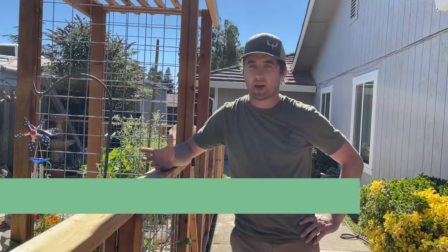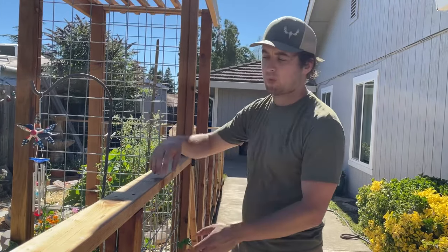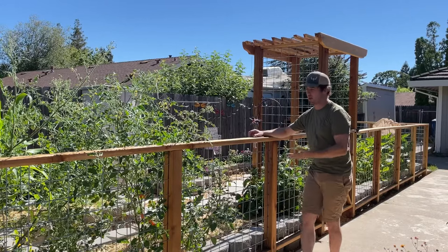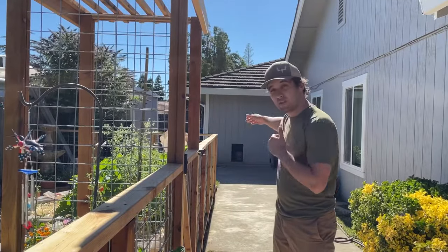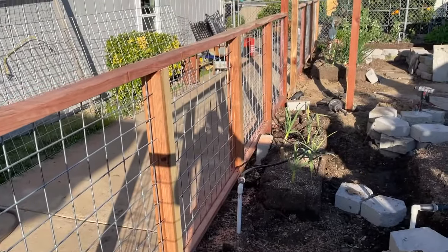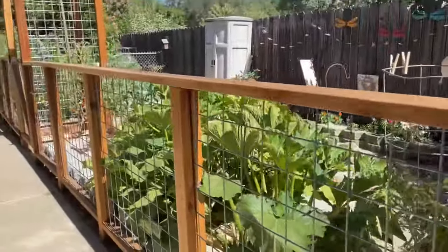The last step is setting your top bar — lay as long a piece as you can across the top and screw it in. Use a string level to make sure everything is level before setting the posts. For long runs — this one was about 14 feet — be really picky at the lumber yard and pick a nice straight board. It'll make your routing much easier; a warped board makes routing the bottom rail tricky.